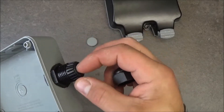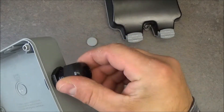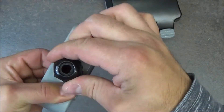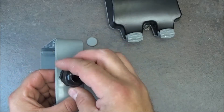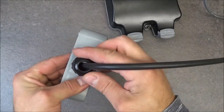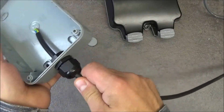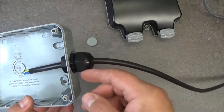On the other side it's got another nut and there's a rubber washer inside here. What it does is when you put the cable through and tighten the nut, the rubber washer becomes smaller and smaller and tightens around the cable, so it's completely watertight. I'll show you — when you tighten it you see there's no gap between the rubber washer and the cable. Obviously you can pull it in and out unless you tighten it even more. This fits also a 20 millimeter hole.